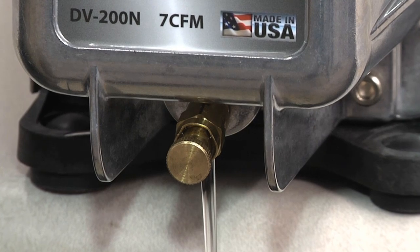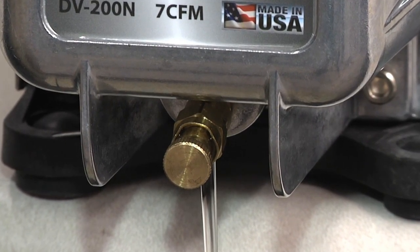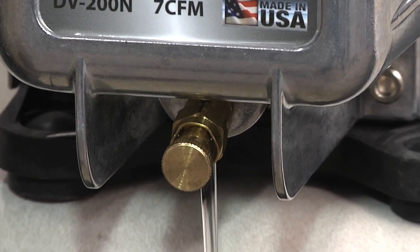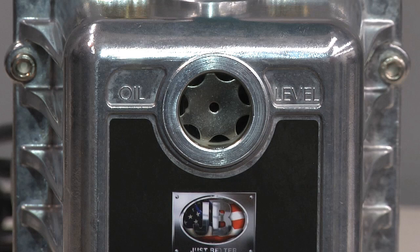The oil valve is actually a true valve — it's not just a screw with an O-ring — so you can't open it too much where it would fall off into the bucket like some of the competition. Fully open it all the way and let it drain. Again, the hotter the oil, the better, as it will drain faster.